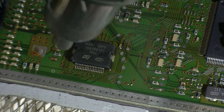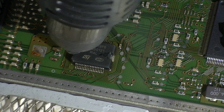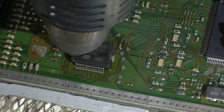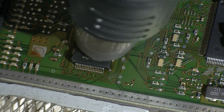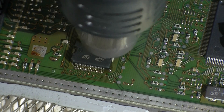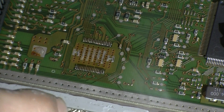Let's see if we can get a little bit closer there. It's simply just a timed thing — we don't want to damage the board. It should nicely liquefy. There we go — we're about to lift it off. Nice, there's our IC. We'll just put that aside.